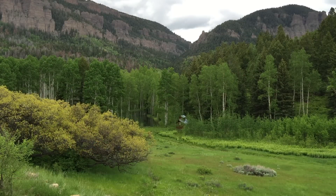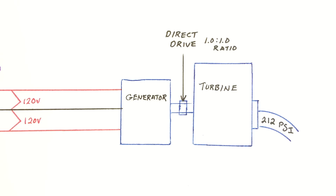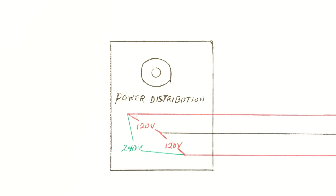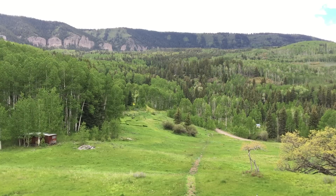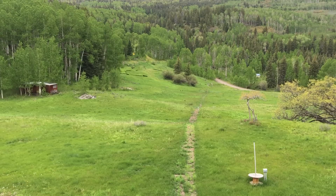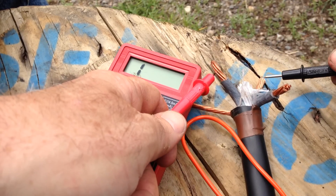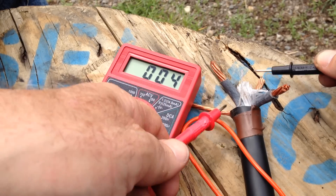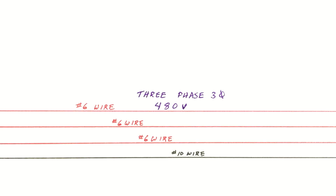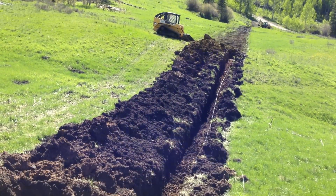On our original configuration, the transmission distance was only 300 feet. We had the turbine connected direct drive to the generator and wired to output single-phase 120/240 volt power in a very standard single-phase configuration. The new configuration needs transmission to go nearly 1,100 feet with a greatly increased amount of power, meaning increased resistance and potential voltage drop. We used direct burial number six gauge wires with three conductors and a number ten gauge grounding wire. This can enable us, at some point in the future, to add a second water jet and transmit three-phase 480 volt power should the need arise.